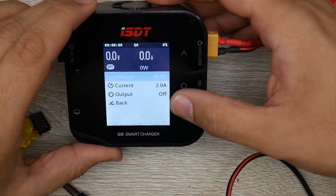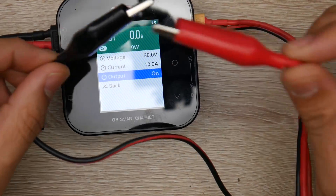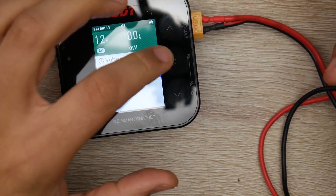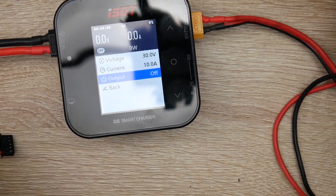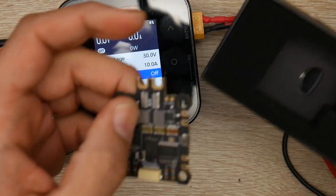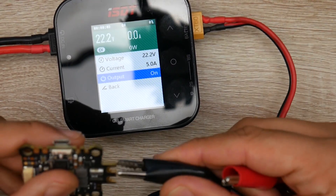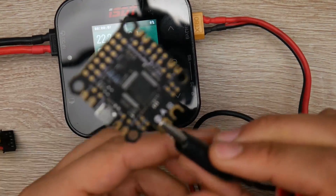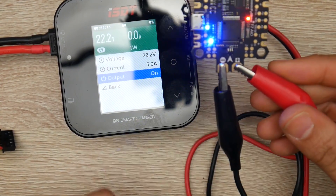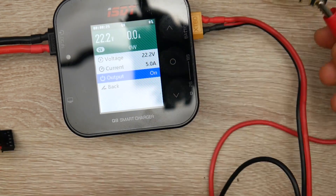So the moment of truth — we're going to do 30 volts, which is really dangerous, and 10 amps. Let's go ahead and see what happens. We should see a nice spark possibly. Nothing... oh shit, there we go. That was a nice little spark. Still responsive — that's really great. Let's see if it still has anything. We had a really nice fat spark. Let's grab an all-in-one flight controller and see if we could power this thing up. 30 volts might be a bit too much here. Let's see what happens. We should see this thing boot up if everything is done correctly. Yeah, it's booting up — so that's really nice. I don't think it's actually cutting off when it's shorting out, which is kind of interesting.